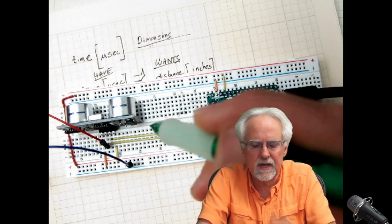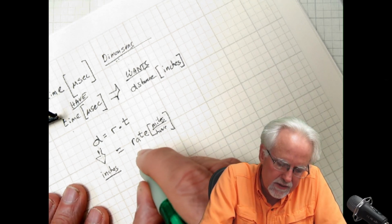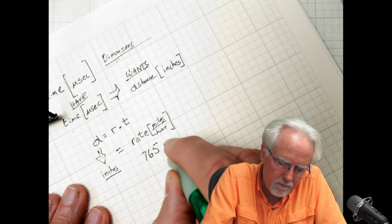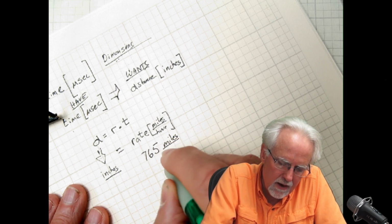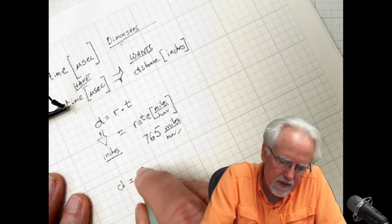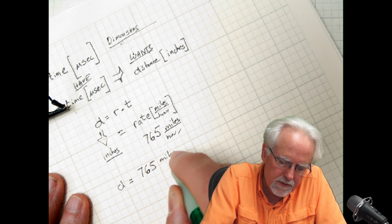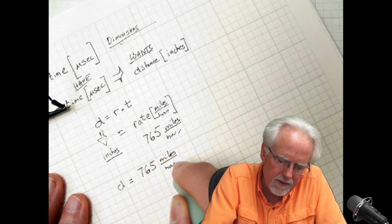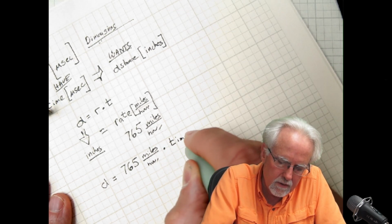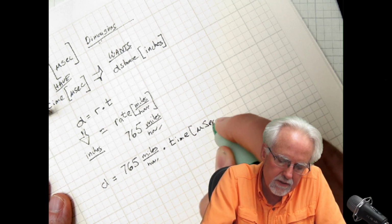What is the ping? It's a sound wave. How fast do sound waves go? We know that they go at 765 miles per hour. All right, so we know that distance is going to be 765 miles per hour times time. And our time is in microseconds.